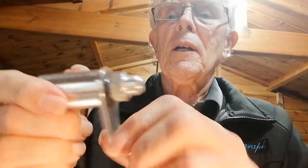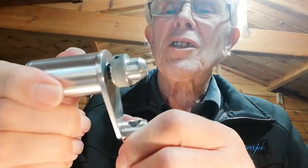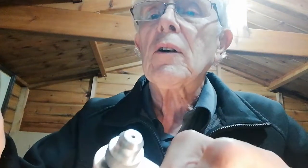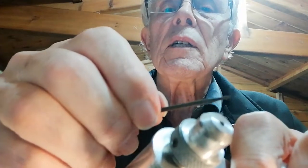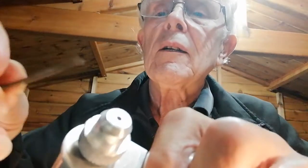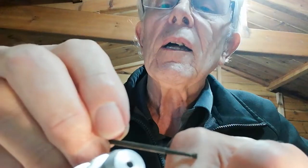So what we've got now is an adapter, like a little chuck. So what we can do then is to fit various burrs for deburring and rotary files and even drills, because you can get these sort of things which are variations — and that's a rotary file for instance. And then you've got different shaped ones — that's a conical shaped one. And then we've got an angled one, like a little dovetail one. You get a selection of these and it's quite inexpensive, really — the type of things that you could use with the Dremel.